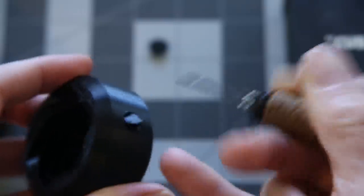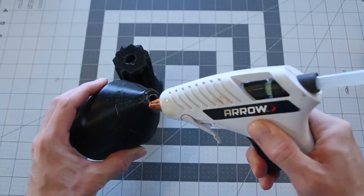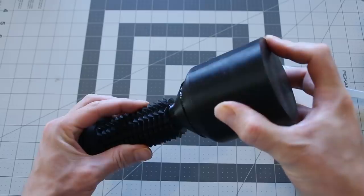With this method, it's important to fill the mold from the bottom to the top. This way, as the plastic is melted, all the molten plastic, smoke, and gasses safely exit out the vent.